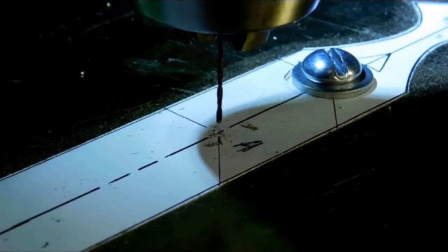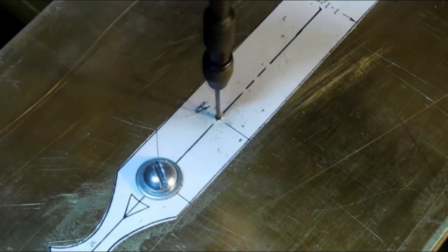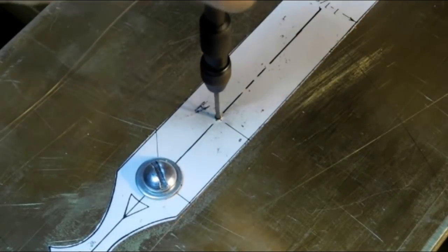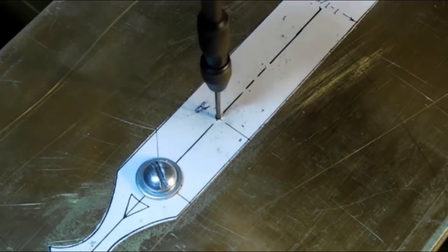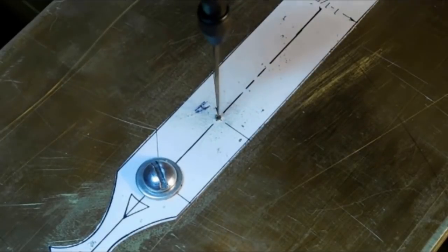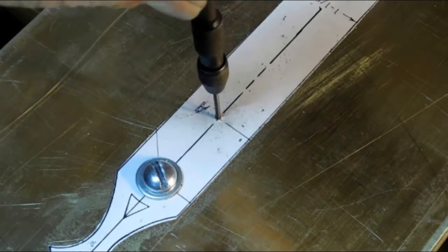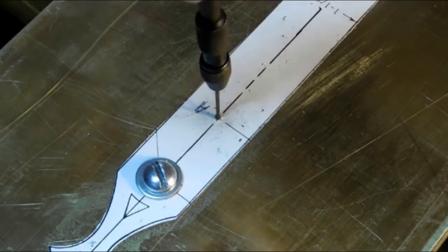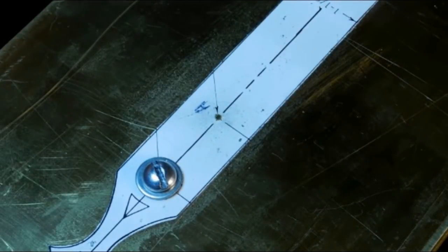And now I've just put a little center drill in there, but now I'm running it through with a small drill. We're going to be putting a pin in there. I'm using a five-sided clockmaker's broach. Normally you just use these on small bushings. These two thick plates with this five-sided broach is taking a little bit of time, but I've already done all the work. I'm just finishing the holes off here now, pretty much just for the camera. But let me get them in here, and we'll pop that pin in there.